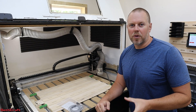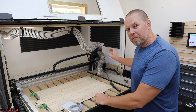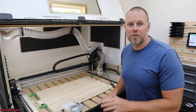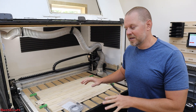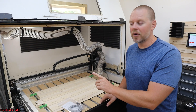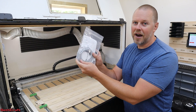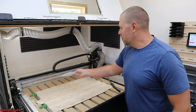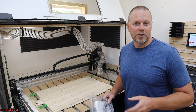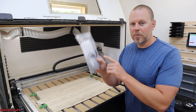With the help of tech support, the first thing I did was swap the left and right side Y stepper motors. I took the one from over here, put it over there and swapped it back. The machine actually worked well for about six hours of runtime, and then the left side started going off again — which means it's not the stepper motor. Hopefully it is the wire that goes either through the middle here or through the drag chain. Tech support wasn't sure which one it was. I tried wiggling wires and never heard anything, but I've purchased both of them.